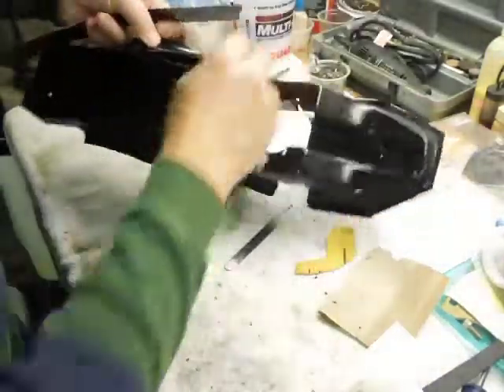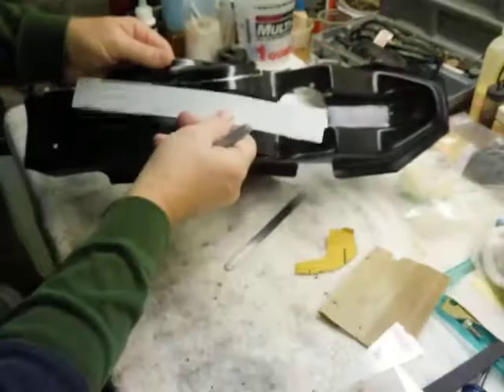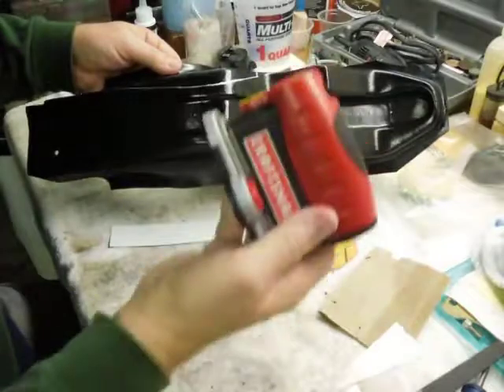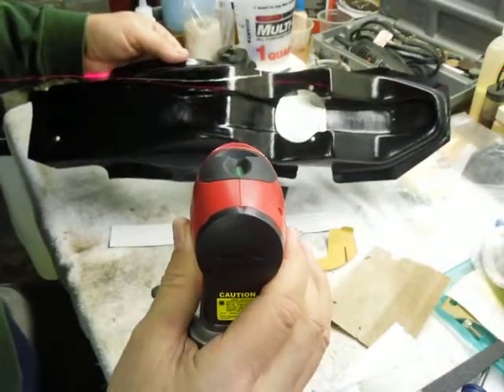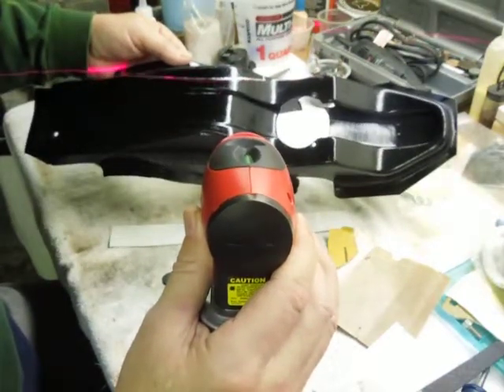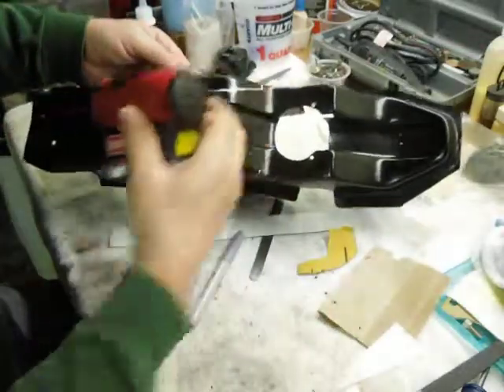But in this direction, because I want that curve at an angle, if I try to use my straight edge, it runs off to the back. So what am I going to do? Well, here was the answer. I've got a laser level. Basically what I did was I got the part on the angle that I wanted it to be on and let the laser level draw the straight line, and then I just transferred it to the part.